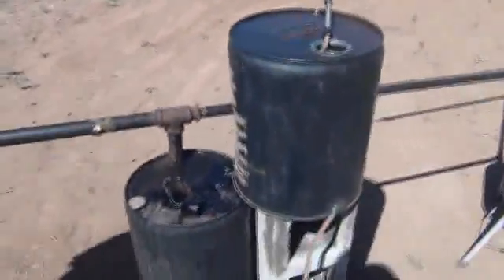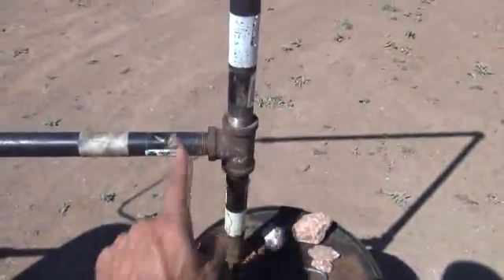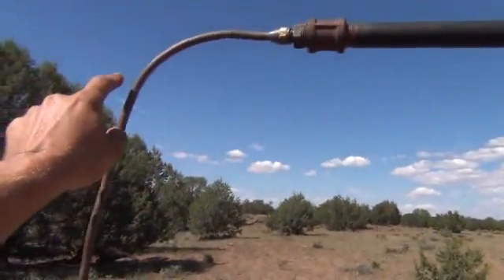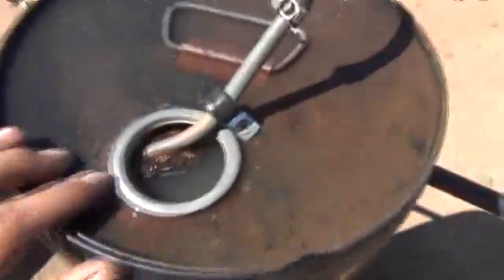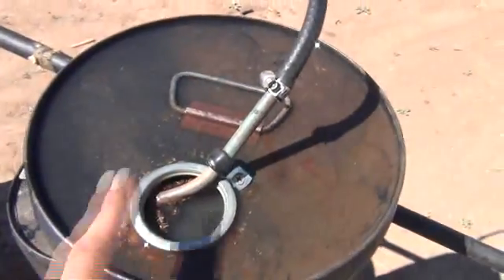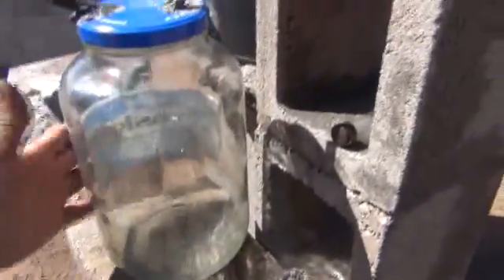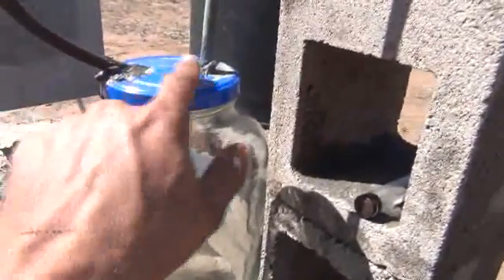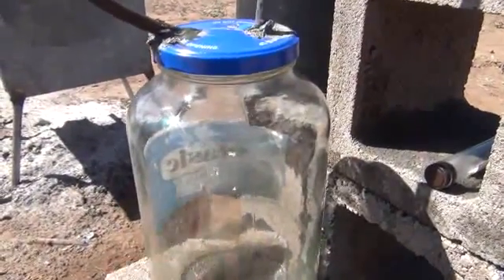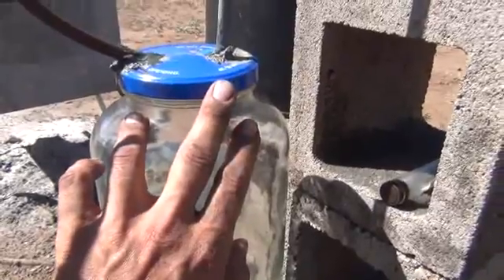Let me go through here and show you the rest of it. It goes down that pipe from a reduction point into another T — this is our secondary catch. Comes up the hill with the lighter gases, not yet condensed. Rises across, loses a lot of energy, and is now once again restricted into a quarter-inch copper gas pipe. That runs down here into a condenser that's full of nice cold water — it's got a little bit of pine needles from the pond. I've got a nice 20-loop condenser coil inside of this five-gallon tank. Running out the bottom of it, you see the pipe running here into the top of this one-gallon pickle jar. It just comes into the top of the jar, and the next pipe comes out of the top of the jar. We're not putting it too far down because you don't want it bubbling once it starts to fill with crude oil — you just want it grabbing the lightest gases: the hydrogens, the nitrogens, the carbon monoxides and others still left in the system.